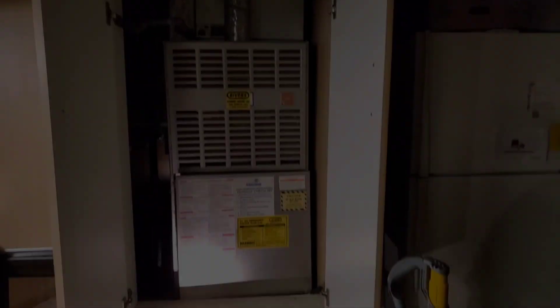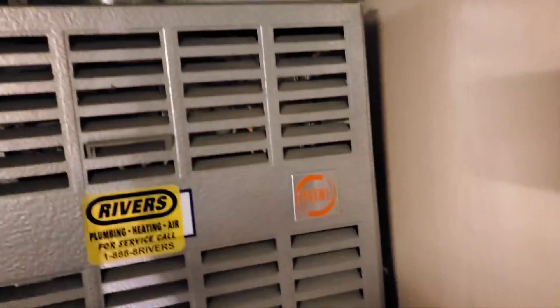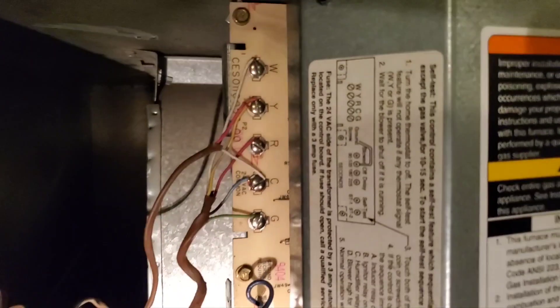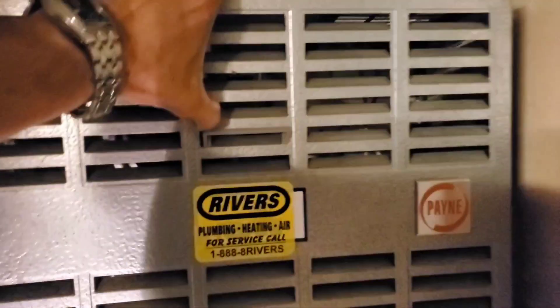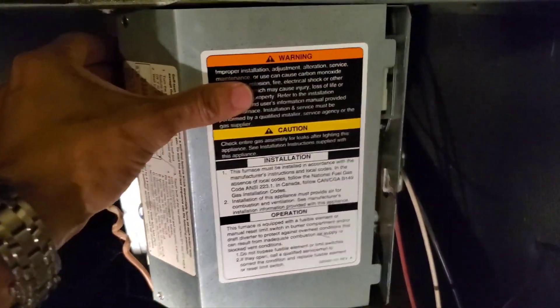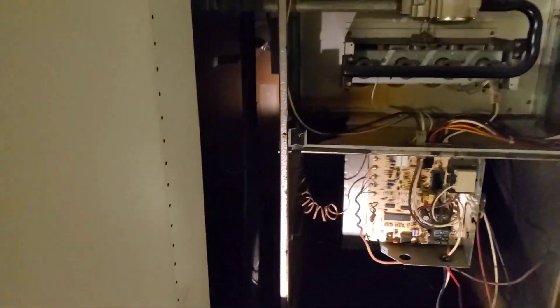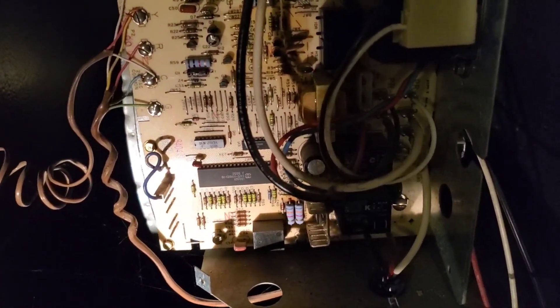Let me show you where that fuse is. I'm in my garage now and this is my HVAC unit — they're all built more or less the same. I had already loosened this panel to get to the circuit boards. There are those wire colors: white, yellow, red, C and G. I'm taking this panel off as well. I had to take off a screw here and here, and you definitely want to make sure that the electricity on the main panel to this system is off, or you can get a nasty electrocution.